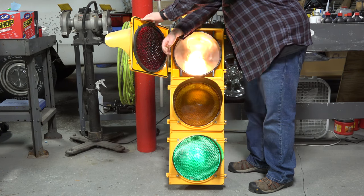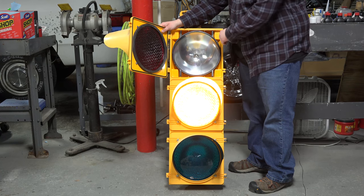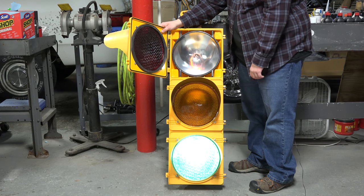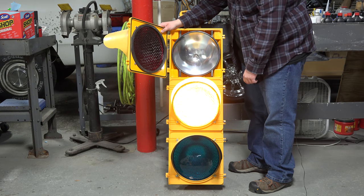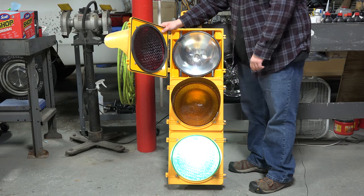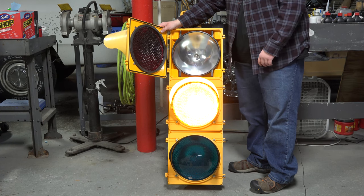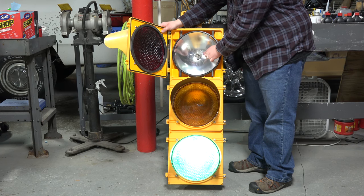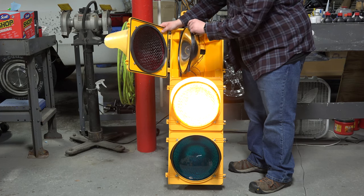The lens is also made of plastic or polycarbonate, though they also make these in glass. They also make metal signals which stand up a lot better to weather and any kind of impact. The bulb this one uses is just a 67-watt traffic signal bulb — they make a bulb specifically for these because they're on literally all the time. They also have a 135-watt variant. Normally this would have a 135-watt bulb, but I've taken it down to 67 watts since it's just for show purposes. This reflector is actually made of aluminum — a special kind that's treated to be reflective.